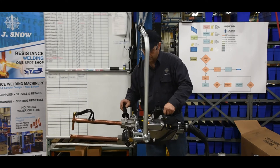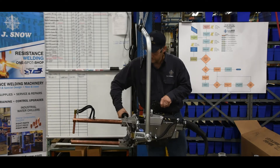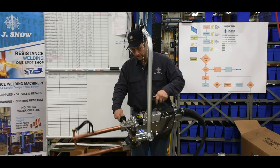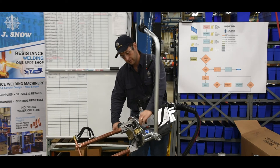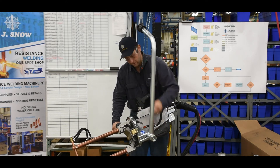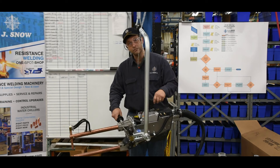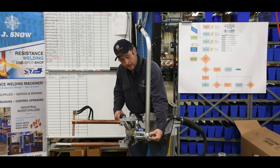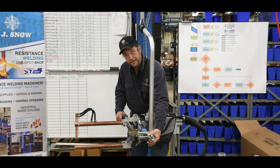So for today we're going to put it on this side. It just screws in hand tight — that's perfectly tight. As you can tell, you have plenty of movement up, down, and around. If you want the machine to stay in a certain position, you can lock the bail screw and it won't spin anymore, but you still have free adjustment from the J-bar support bearing. Once you've determined that everything is set as you want and the balance is adequate, take your wrench and tighten this nut properly, along with the jam nut on the end — I think it's 17 millimeter. Tighten that nut down; it's a lock nut so nothing will come off.